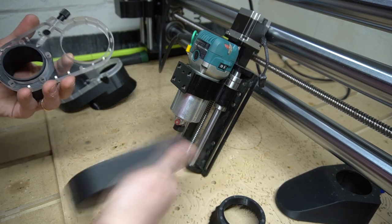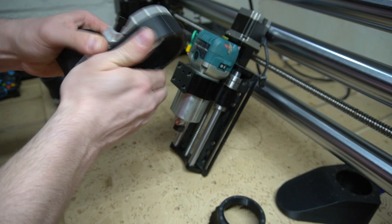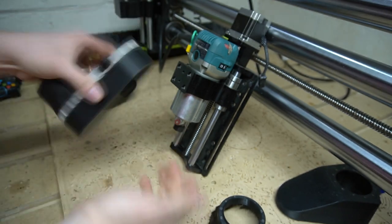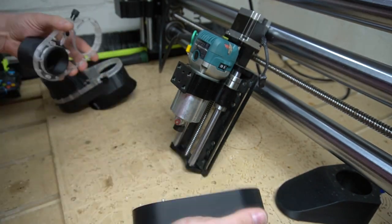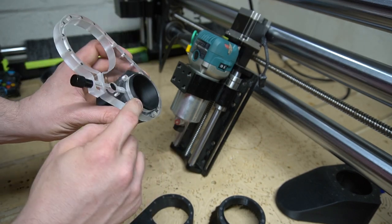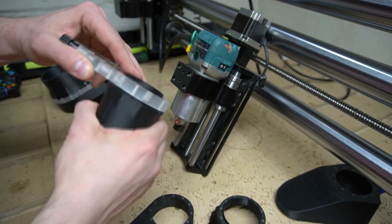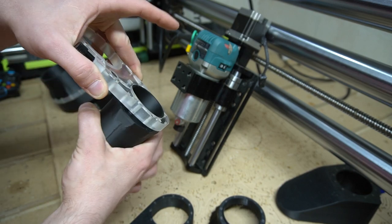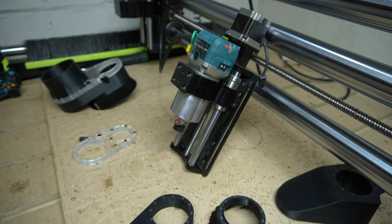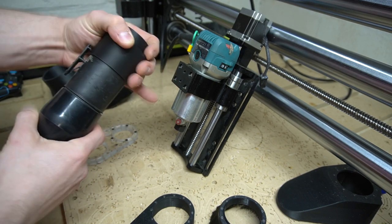There's also a removable bottom. There are two locating studs right here so that when it magnetizes, if you happen to run it into a clamp or something, it can't come off the boot. The only way to get it off is to come straight out or straight down. The hose port is slightly past the acrylic, so if you use a really rigid hose and it starts to pull, it actually grabs on the corner and can't pull out. I use a rigid dry vac hose port on mine — you just push it up on there and it stays on really well.